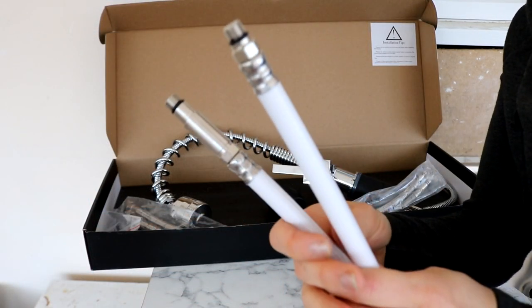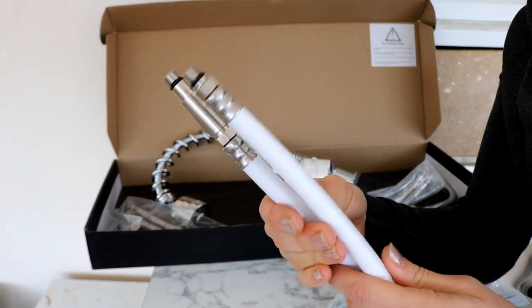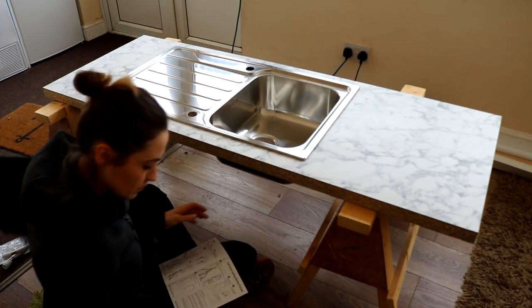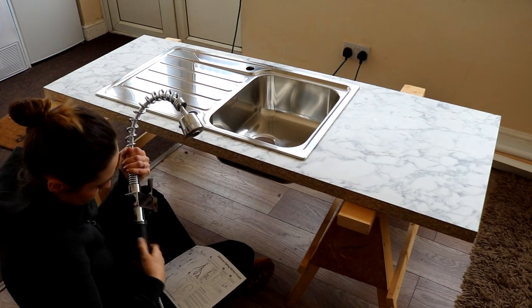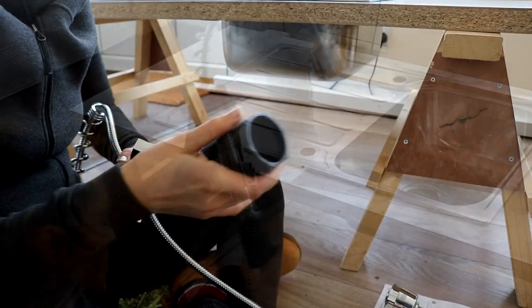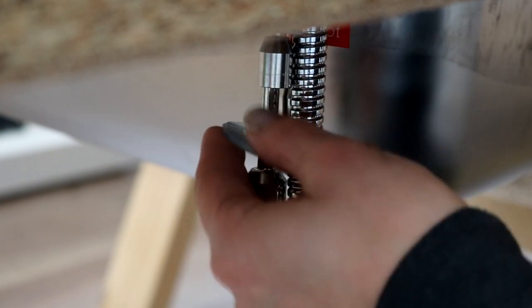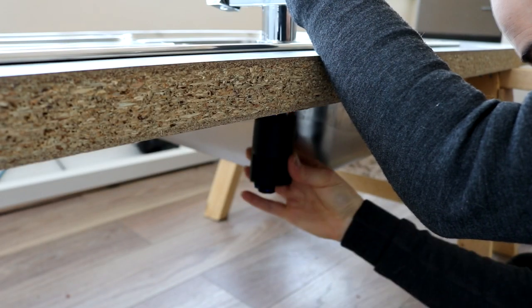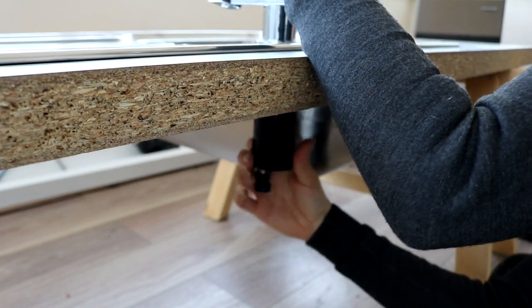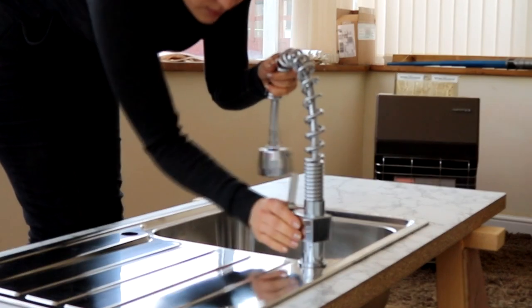You'll also notice that the tops aren't the same, but that's just to make it easier to fit. The beauty of not having my worktop fitted yet is that I could move it to my sawhorses and easily access where I wanted when fitting the tap. I had to unscrew the mounting piece first, then place the decorative piece, which has a seal, and fit a rubber washer underneath. Before fitting the hot and cold hose tails, I'm now fitting the tap into place with a black mounting screw attachment.